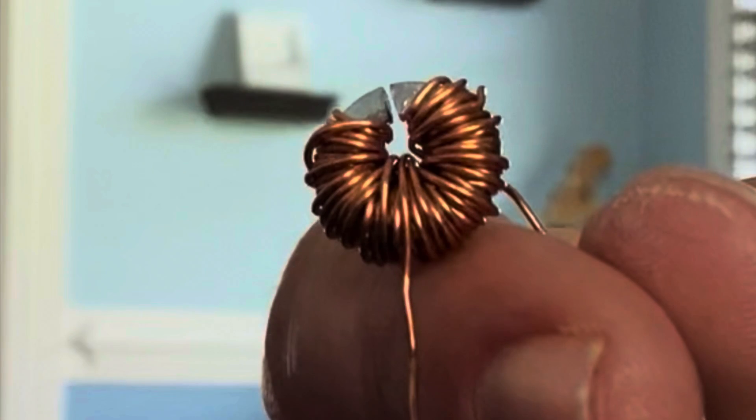What I've learned from all these experiments is that these makeshift tape heads can be made very easily and work well as a record head — transmitting a signal from an audio source to a dedicated play head. They don't function as well as a play head compared to a pre-manufactured tape head, but they do interface with one another fairly well. What they don't do well is read a pre-recorded tape, because the gap is crude and makeshift — professionally manufactured tape head gaps are much smaller, in the range of 10 microns in width. I'm going to use the pre-made tape head and build something with it, and maybe incorporate this into a different kind of noise-making circuit.